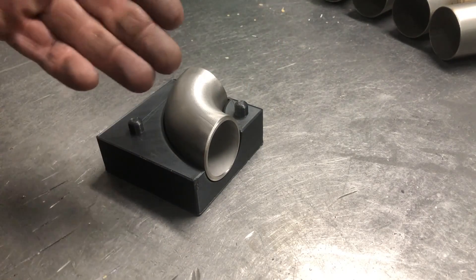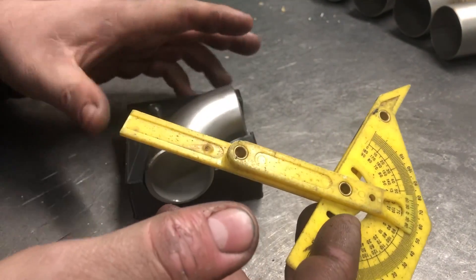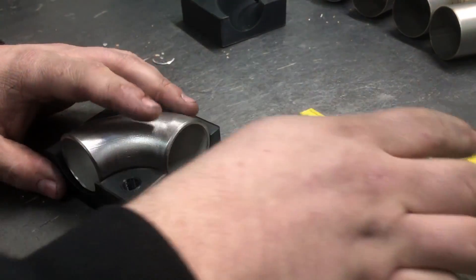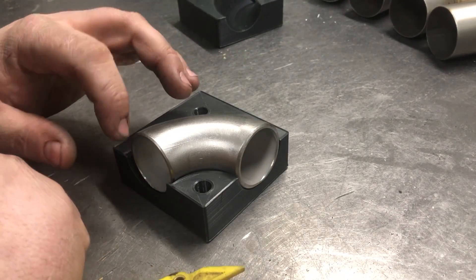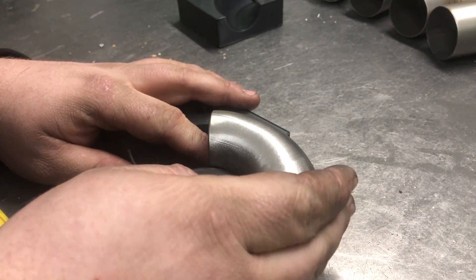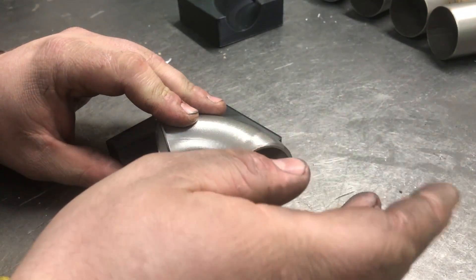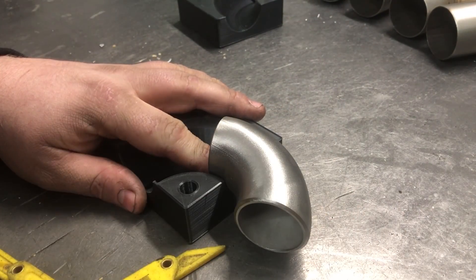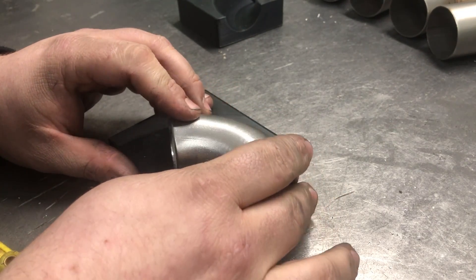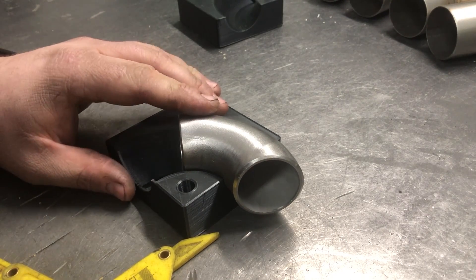There's no built-in angle gauge, so you will need an angle finder — this is a cheap one off eBay, a couple of quid, does the job. I would suggest cutting up to 45 degrees. So if you wanted a 70 degree cut, doing that directly would be impractical, so obviously you'd work backwards: if you wanted a 70 degree cut, you'd cut at 20 degrees; if you wanted a 60 degree cut, you'd cut at 30 degrees, and so on.